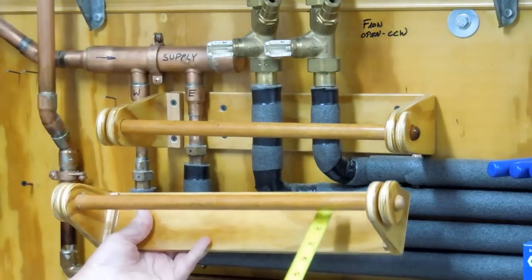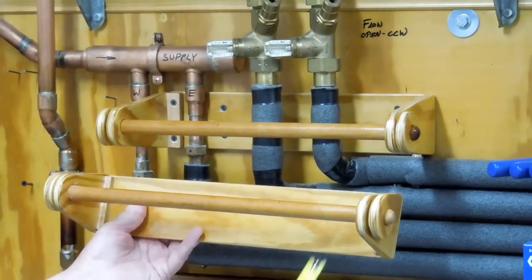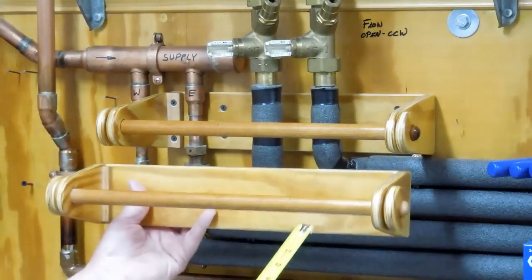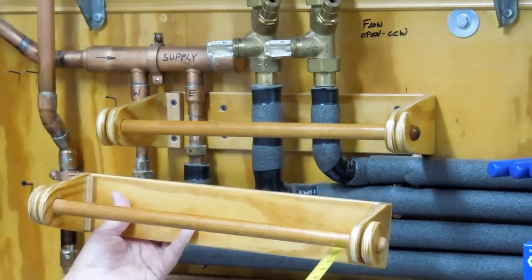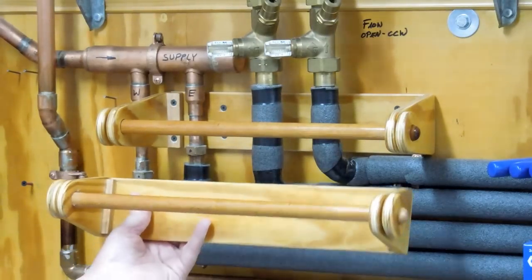This other one: again, three inches back plate, three-quarter inch dowel, two-inch rings, one-inch radius. This one stands out away from the wall three and a half inches, and the spread is 14 and a half inches.